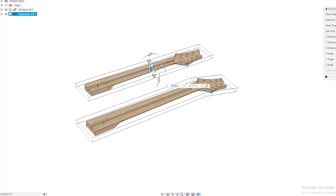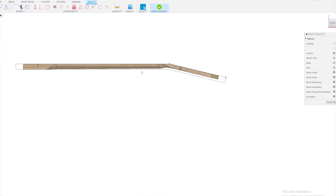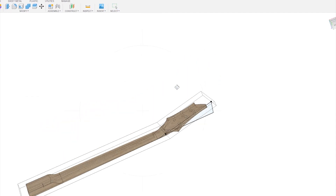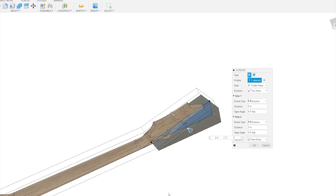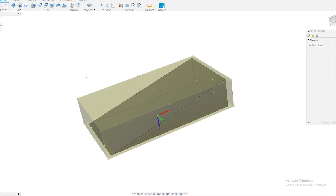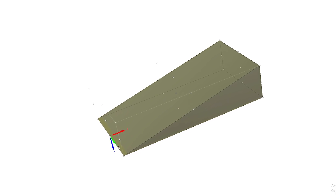Like last time, I will create a new file and import the designs. Fusion makes this easy by right-clicking the project and selecting Insert into the current design. The first obvious point is that one of these necks uses a scarf joint headstock. The second is in the typical Fender style. When we remove the extra material from the back of the headstock, we have to support the headstock angle. I like to build up a temporary support with MDF and hot glue, and use a scallop toolpath to mill the face of the support. I make a quick sketch and extrude the shape to generate the scarf joint and cam. I also use this toolpath to cut the scarf joint, keeping the angle in a tight tolerance that's relied on in later operations. I get a lot of flack over this technique, and I'm not sure that folks understand how necessary these details are.